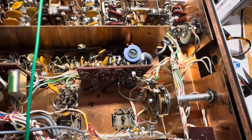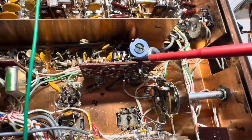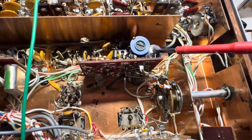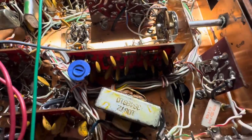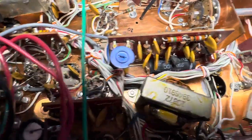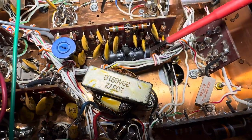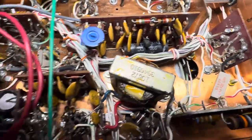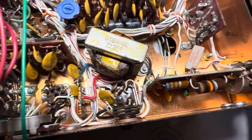On these radios you usually want to replace the transistor for the AGC, replace these capacitors — there's a bunch of things I still want to do in here to get it perfect or at least acceptable. Of course it hasn't really been tuned up at all. Replace that capacitor down there — just kind of muck around with it to get it working well.